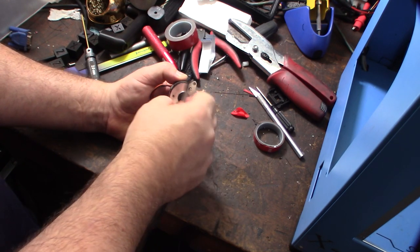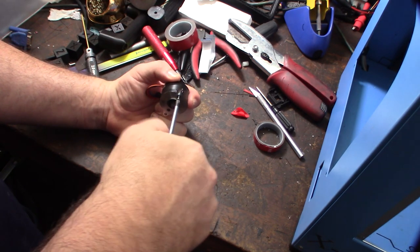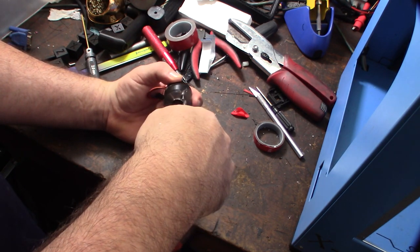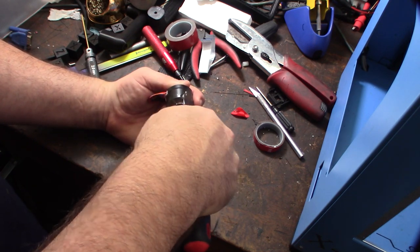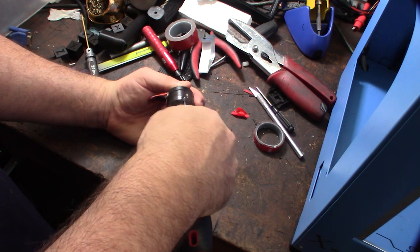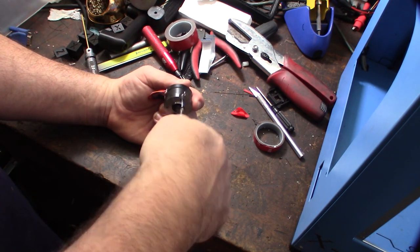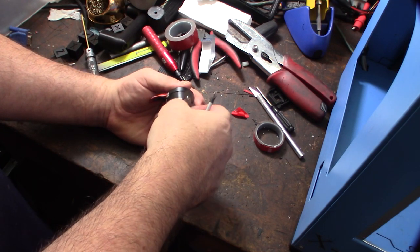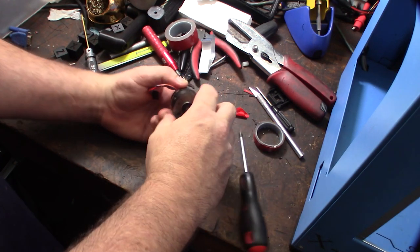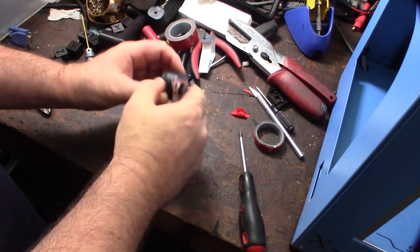What's funny is I kept turning the current up thinking maybe my current wasn't good enough — like what's going on, why is it locking up? I'm glad it finally made it obvious because I was actually fighting that problem for probably about a month. I had a bunch of random lines on my prints I couldn't figure out. I wasn't looking at the motor because you couldn't see it — it would lock up and start again, so it was intermittent and made the whole thing a lot more difficult to troubleshoot.